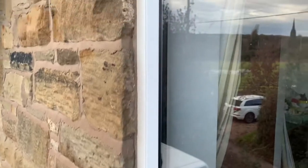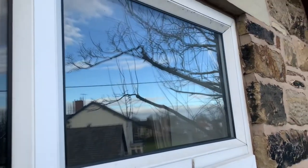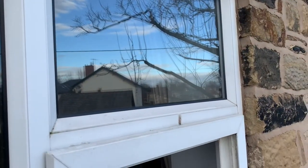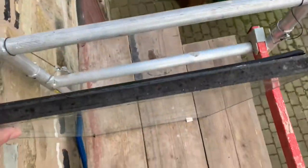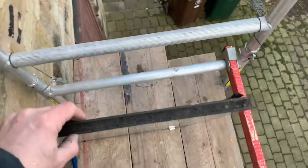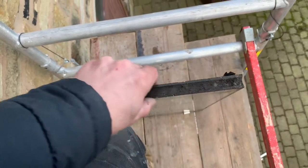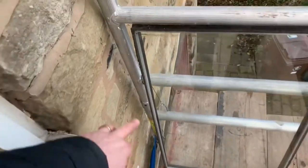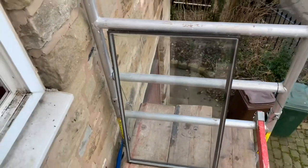That's why a lot of salespeople go around scaring everybody saying it's externally beaded and you need to get them removed — not always the case if the job was done properly. On this occasion it wasn't done properly, so this one does need removing. It's also extremely old. These are thin double-glazed units, maybe 20mm thick, compared to our double-glazed units which are 28mm. Just standard double-glazed units — you've got the old silver bar, just two standard pieces of glass sealed together. That was it, really.